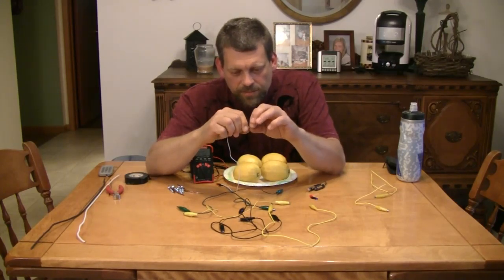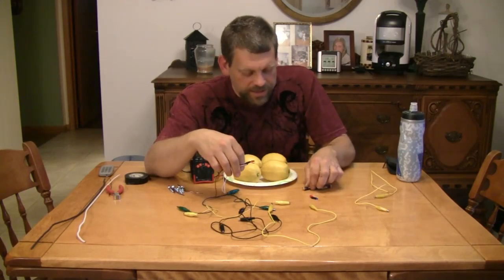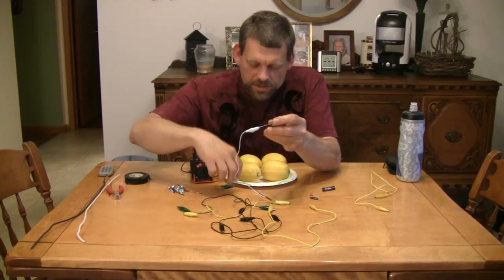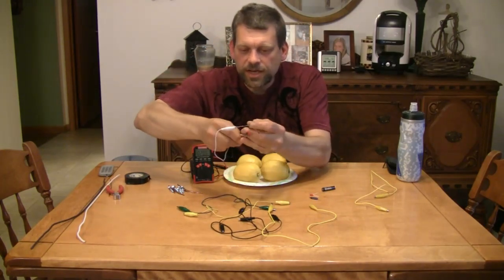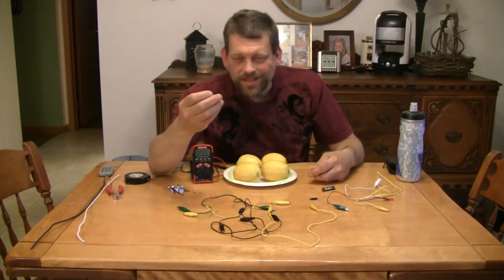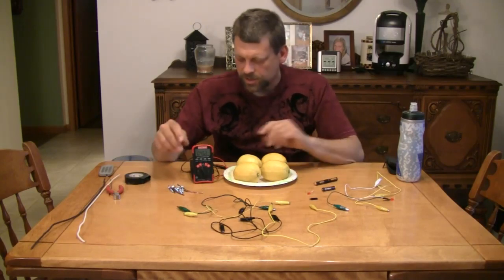You can find a resistor at about any electronics component store. A resistor impedes the amount of current that can flow into this light-emitting diode, or LED. I want to show you that these LEDs do light up — they will not light up with a single 1.5-volt battery, but with two 1.5-volt batteries they will light up. I'm using my limiting resistor so I don't blow up my LED. There, it's lit — see that light up? Pretty cool. I could also take my standard LED and hook it to this battery, but it may draw too much current and could actually explode, believe it or not. You won't need a resistor for our experiment though — I just wanted to show you that the LED lights.